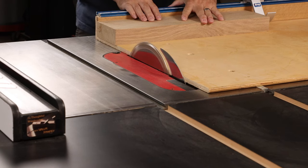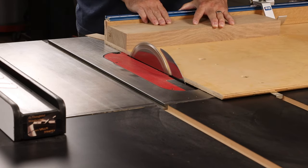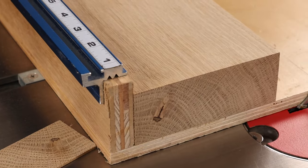There's no rail going all the way across the blade, and that's really a key difference between the one-rail and two-rail systems. As long as you build your sled from half-inch thick material, you'll still have a really nice cutting capacity — basically the full three inches you can raise the blade, minus the thickness of your sled. That'll be your maximum thickness on the table saw.